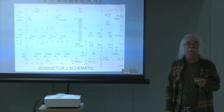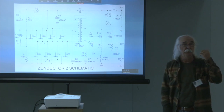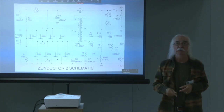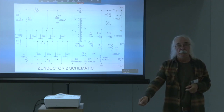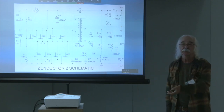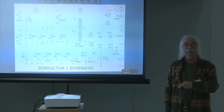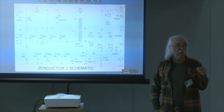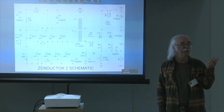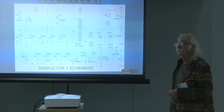We provided a regulated desktop supply, which is 16 volts at, well, these are rated like 4.5 amps. They're plenty of current. However, some of them have common ground going to the wall outlet, which is something to remember. Some of them don't. We ended up with two different types. They're equally good performance, but one of them has the AC ground running as the negative supply. For that purpose, in case somebody has a problem with that in the system and they're hearing hum, we've provided also some AC adapters that allow you to float that relative to the other grounds that might be in the system.